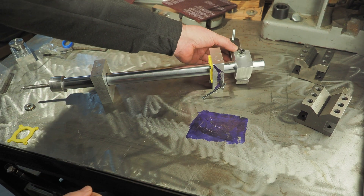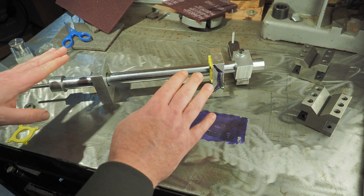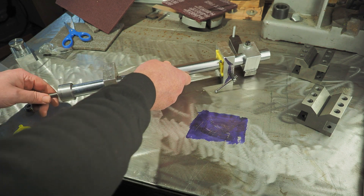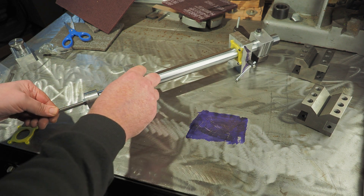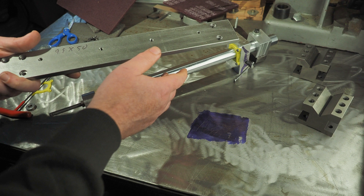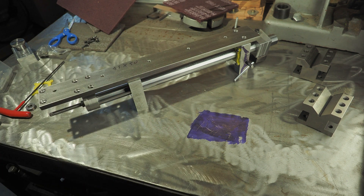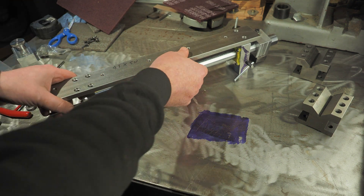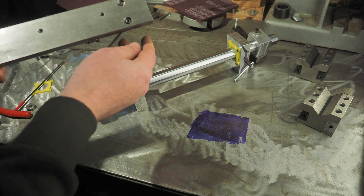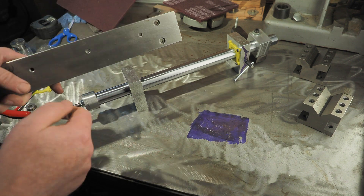The way that works is you just get to the position that you want and if you want to adjust it you just screw this in and out. So now that you've got all those components the next thing you need to do is attach these to something firm and then you need a way to actually control the linear motion. To attach this, what I've got here is a 9.5 millimeter by 50 millimeter by about 426 millimeters plate. It doesn't have to be perfect. I've got this countersunk for M5 screws and there are also some other holes here. So I'm just going to assemble this - let's go to the time-lapse.